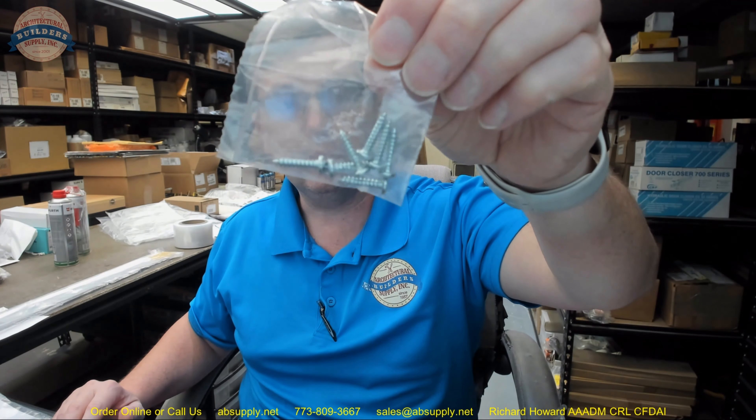Speaking of those holes, screws are included in a complimentary finish. Those slotted holes are nice because they allow you to tailor the sweep on the opening to account for a sill that is not level or a door that is not plumb — true level, plumb, and square, the hallmarks of hanging a door. Your drill bit also has a tendency to walk a little before it pierces in, and the slot helps compensate for that. This gives you the right amount of seal so your door closer can still get the door closed. If it is a fire-rated door — and you can order this labeled for fire-rated compliance — you need to ensure the door automatically closes and automatically latches in all means of activation.